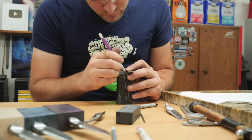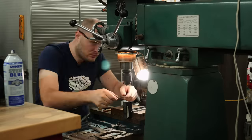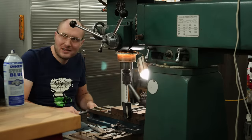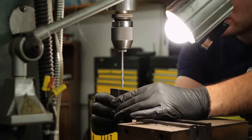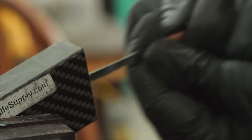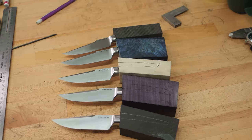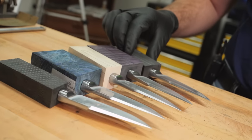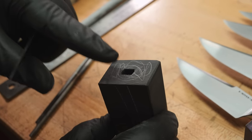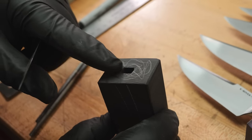I give myself layout lines on the end of the handle so I know I'm drilling in the center. I chuck the handle in the milling machine and begin drilling holes side by side that should connect and leave a slot for the tang. For the tricky part of connecting the holes, I use a drill bit with some sideways pressure — not really how it's meant to be used, but it does work. I got done drilling and broaching out the hole for the tang slot and it looks really nice, though it took quite a while. This carbon fiber is really nasty to work with.